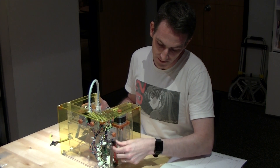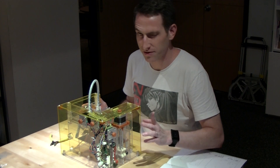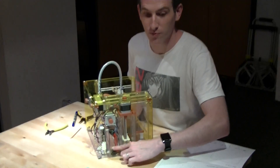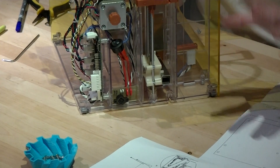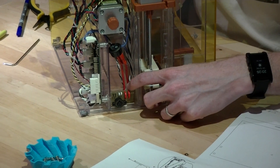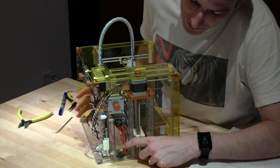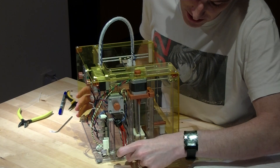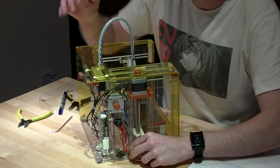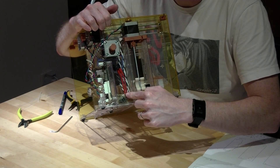I will be putting the switch in place. In the original instructions, this power board was being put into place. In the revised power board design, this was put in much earlier in just the second step. So if you haven't put this in yet, you'll probably have to take out some screws, pop open the chassis, and basically pull this corner down enough to get the board in place.